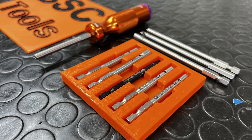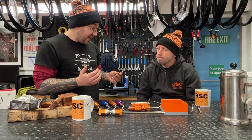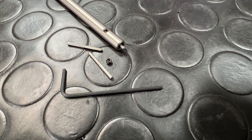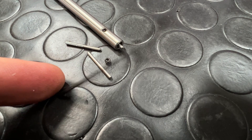I find the BSC Tools drivers don't slip — nice and firm. Back in the day I had to make my own depth gauge on my tools, but on a BSC driver you've got these really nice pre-made pins, which I really appreciate. It saves me a lot of time. The grub screws are really high quality, the pins themselves have a nice flat for the grub screw to grab, and I think you ship an appropriate Allen key with them? Yep — I'm forever losing mine, so having it shipped with the tool is great.